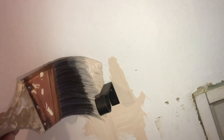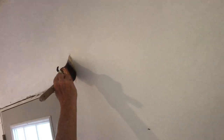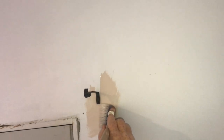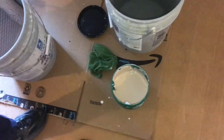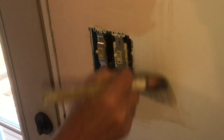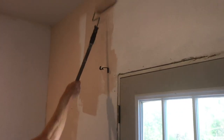Use your paintbrush to cut everything in — if you've got a nail or a bracket, cut it in with the brush, then the roller will make everything nice, clean, and consistent. The quality of the brush makes a big difference, and you've got to know how to clean it. Use a wire brush to get everything clean and keep the bristles straight. There are all kinds of good quality brushes — we use Purdy brushes; it's got to be a good quality brush with a nice tip. A cheap brush or cheap roller will leave hairs behind and won't give you that even, clean consistency.